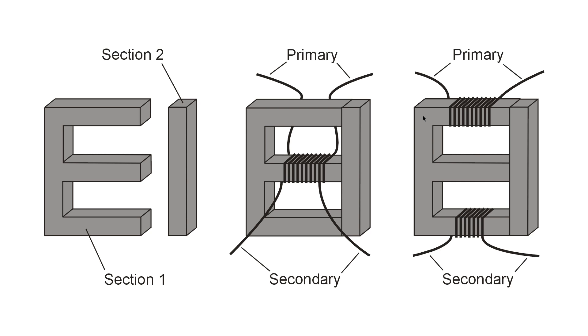These are probably the most common configurations, although there are others. In some designs, when you have the winding over the top and the bottom of the theta, the center bar can be removed and you get a C-core, which can also be called a U-core if you tip it 90 degrees counterclockwise, or a D-core if you switch it the other way around. This eerily begins to resemble a toroid core — all it would have to be is circular and it would be a toroid.